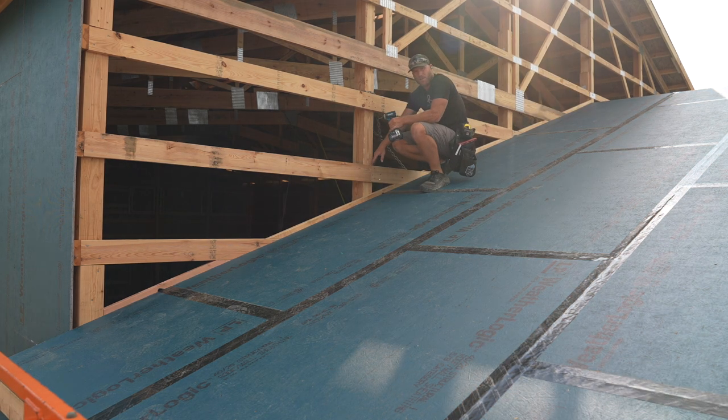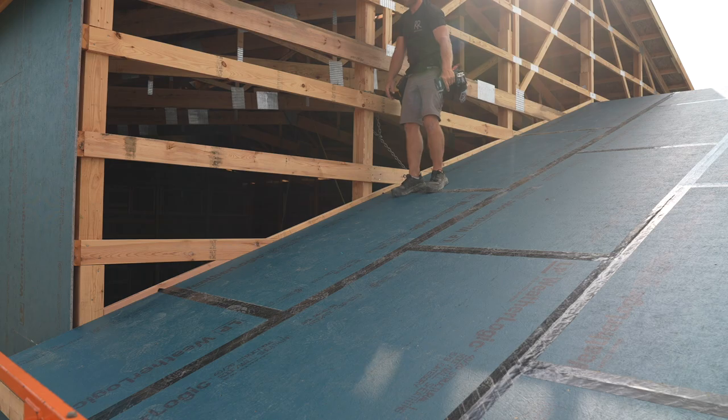That's just gonna run up the length of the roof line, give us a nice place to nail on. All of our sheets will stop with a nice break on a girt, so they'll just be little triangles that we have to fill in top and bottom. I'll do the other side and then we'll be ready for sheathing.